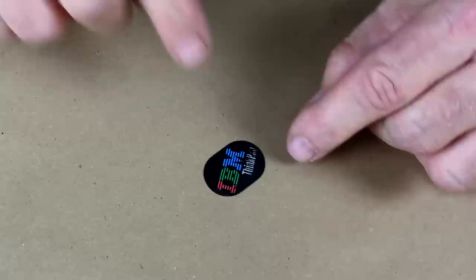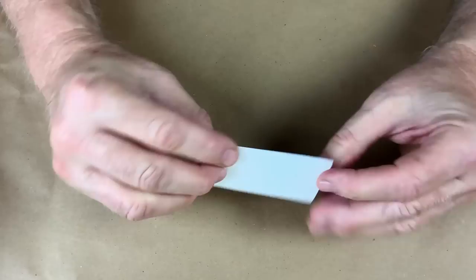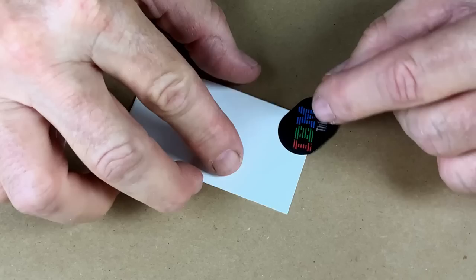The first challenge is that we have to scale the sprue and the vent to the size of the object — it all has to match up. So I found this piece of coated cardstock. It's very thin and it's plastic coated, so that's good. Let's see if we can use that to create our vent and sprue.